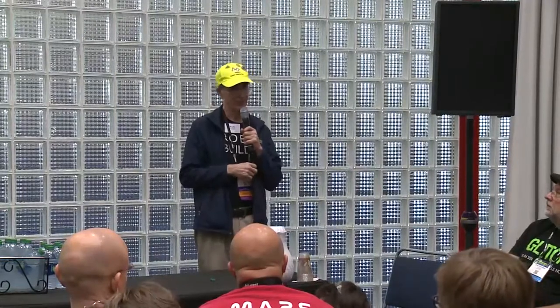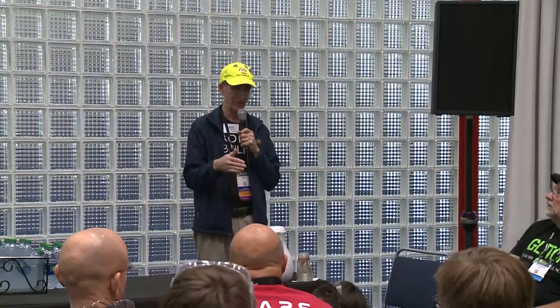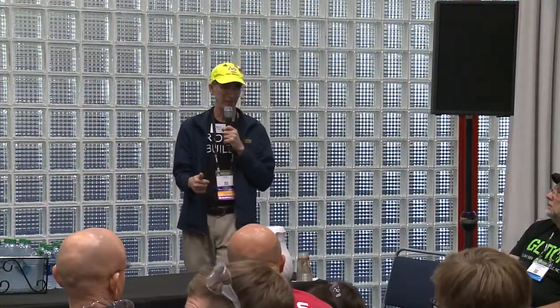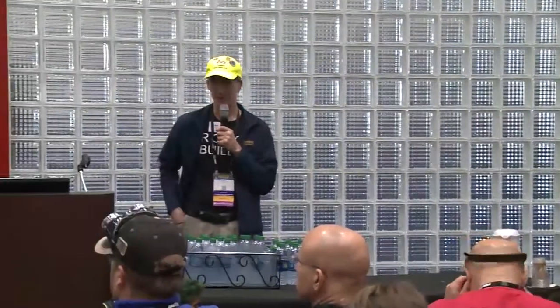And sometimes it's a motor that's not working. Let's say on your drivetrain, you're finding out you're turning just a little bit and you have a little more control, and you've got two motors. Maybe one of the motors isn't working, and that'll affect it a lot. You'll brown out a lot because it's going to cause the other ones to work harder. You can add other motors to make it work better. If you have one 775 motor on one side of the axle, you could put another one on the other side. You have to reverse the directions as well, so they work. Okay? Any other questions?